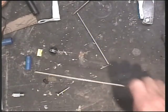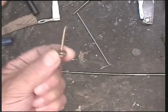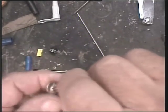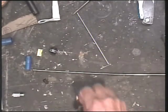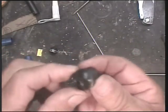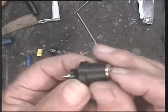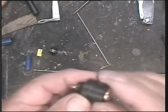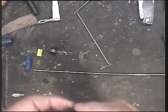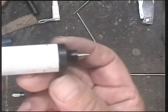The buzz check is made out of 8th welding rod. Got a small piece of rod, so long. Soldered a washer on the end, like so. Machined up a small piece of plastic that would fit the tube I had, drilled it, so that that would fit in there. That's the end of our probe. If you haven't got a lathe to make this, you can make it out of cork or anything you like, really. And then the whole thing clips into there and becomes the probe.